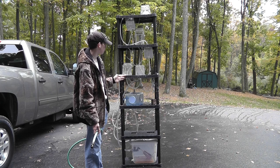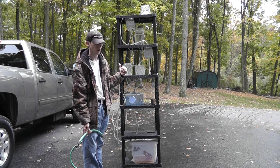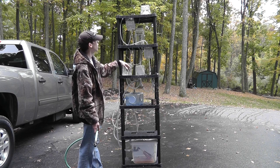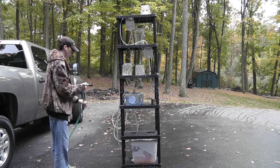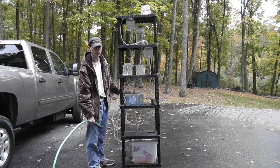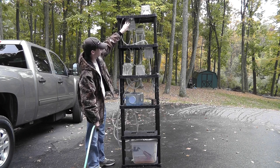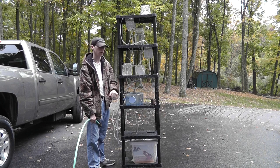And with this thing right here, over X amount of time, because there are these tiny little capillary tubes, there's not much to pull up. They could probably go even higher than that. I want to trade this off with 3/8 inch tubing, but this can go much higher than what you see right here. The only thing that limits how much this thing can climb is the volume of the tank. The volume of the operating tank determines how much suction and how much pressurization there is into this pipe that pushes and sucks. That's the only dependency on this whole device.